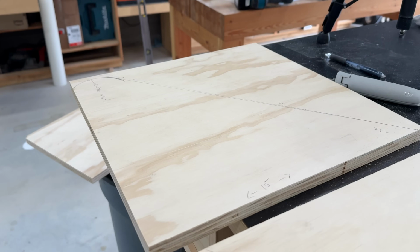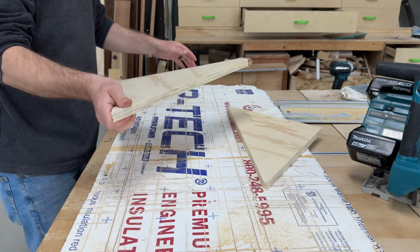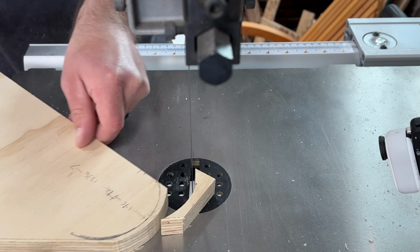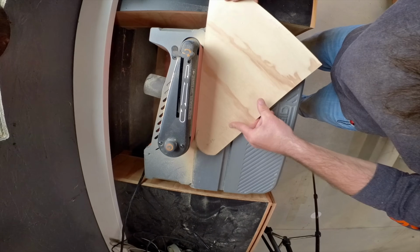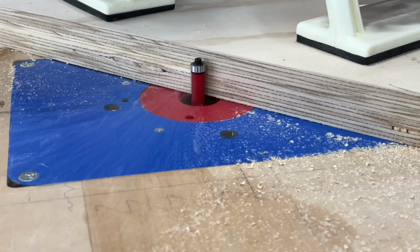The first item to build is what I'll be calling the hinged mounting bracket. This is kind of the heart of the project. It's what holds the overarm assembly to the nearby column and allows it to swing out of the way. I did my best to keep this as compact as I could, but I was limited somewhat by the fact that I'm using 4-inch PVC, 4-inch flex hose, and it will need to swing upwards.